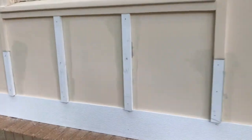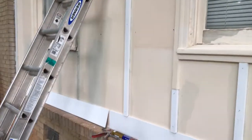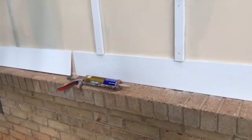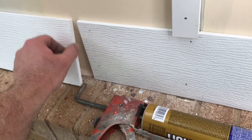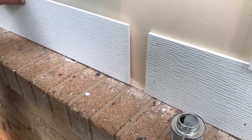We've got some of our little uprights — the one-by-two strips — actually in place here, cut and put back. We're just moving on, with our one long one there. My friend Mint Hill Tina ran up to the hardware store for me to get some PVC cement, because you can actually put some on each edge of this PVC siding and glue the pieces together for some added strength.